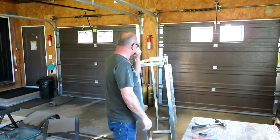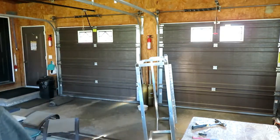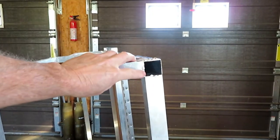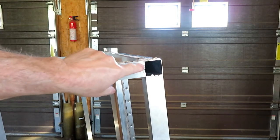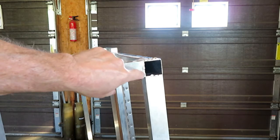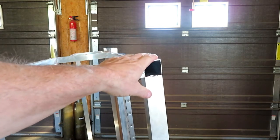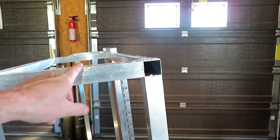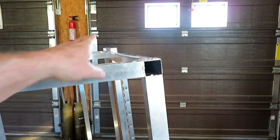The next step is I'm gonna hacksaw the spot weld — it's spot welded on two sides, front and back. I'll take my hacksaw and cut straight along the edge in between the two pieces on both sides, separate the top from the bottom. Then measure down five and a half inches and mark each one of these six supporting beams, cut them, and place the top back on.